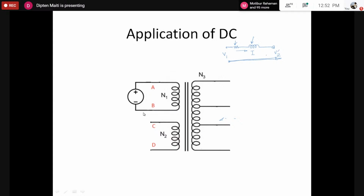So usually the drop across the resistances and reactances total is of the order of 5% for a well-designed transformer, and in some special cases that may be higher. However, that is deliberate because that is the requirement. Otherwise, for a well-designed transformer, that voltage drop is very small, of the order of 5%. So now you can consider what is the very low value of reactance. That means if you apply a rated current, the voltage drop across the resistance and reactance combined would be 5% of the voltage. So that means your logic that the reactance value should be as high as possible is not valid.